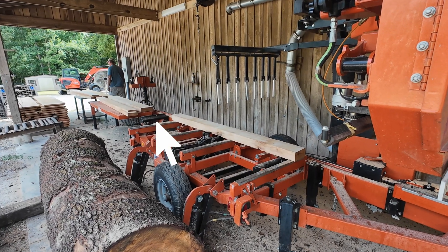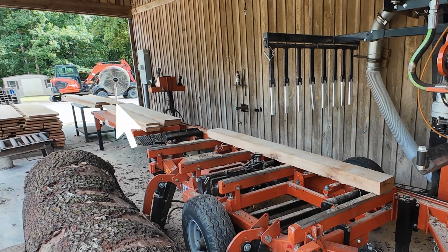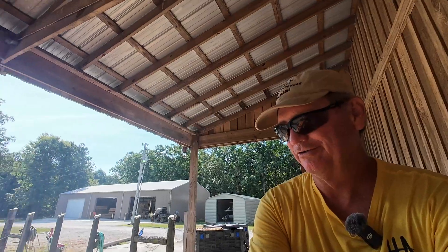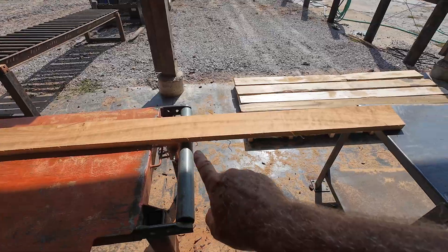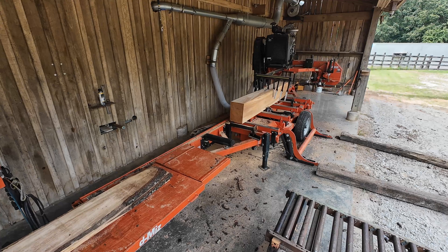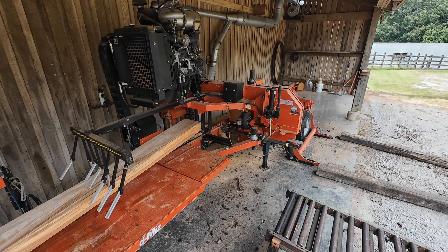In the last video — I'll see if I can find the clip — you'll see several times where I was able to saw an entire log besides the slabs and stack them all on this table without stopping. If I had a hydraulic mill with a drag back, I would not operate it until I welded some shoes on there — because it lets me put boards here, here, and here, in multiple layers and multiple rows. It is a huge work saver. If you don't have them on there, you're hurting yourself, trust me.